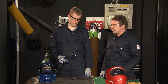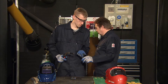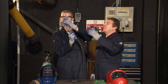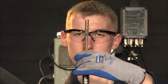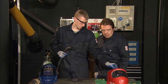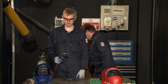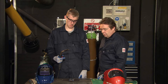We'll need to check the gas flow again using the pea shooter. Take the tension off the wire and hold it vertical. When you pull the trigger we should be reading about halfway — about 16 litres per minute is correct. That's good for this working environment. Obviously if you were working outside you'd need a higher gas flow. Then put the tension back on the wire and we're all live and ready to weld.